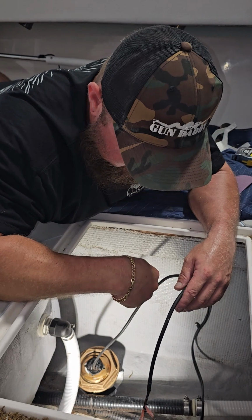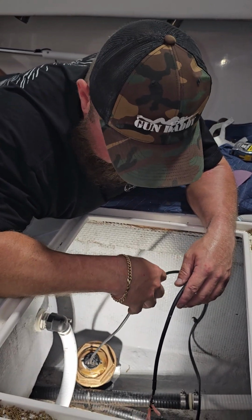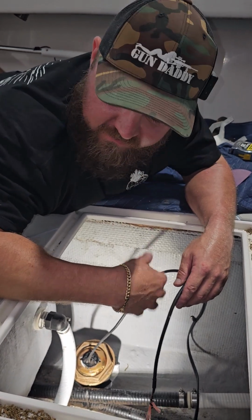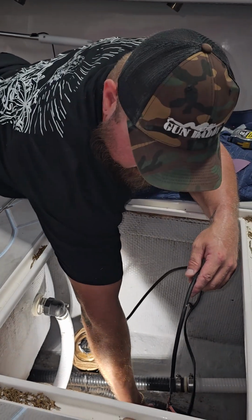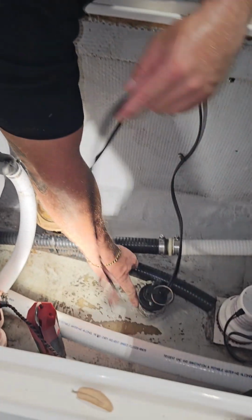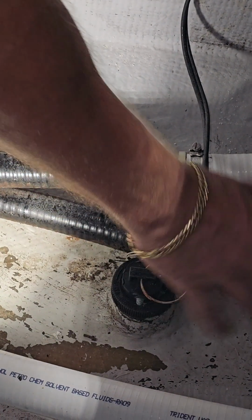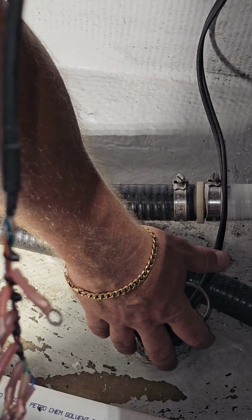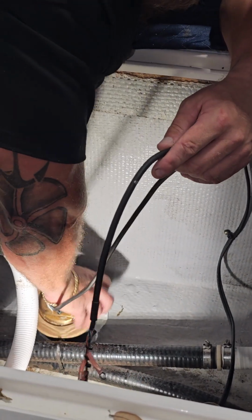And you know, sometimes with these transducers, especially the smaller ones that have finer threads, man, if you get sealant on those threads, it's tough to clean out, and you'll have to use the wrench the entire way down. This transducer here is fiberglassed in, but if it's not, some of them have a really long stem on them, and it takes forever to get that nut down. And if you've got sealant on there, you're going to be fighting it the entire way. So do your best to keep sealant out of the threads. Just make your own life easier.